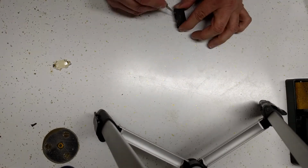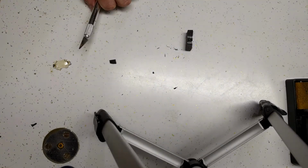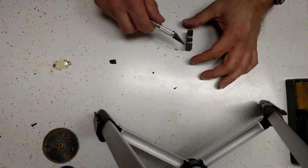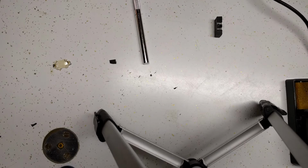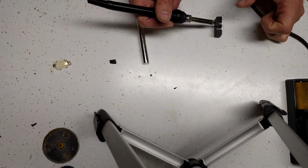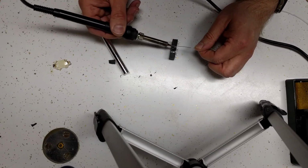So you get that 4th pin over and you sever it. And then you get this 8th pin over here. I guess technically you only need to disconnect the pin from one side, because that should be enough to open the circuit. Let's see, this is a surface mount battery holder. Looks like the side that I severed is the negative side.